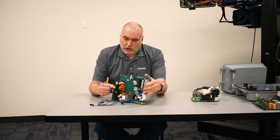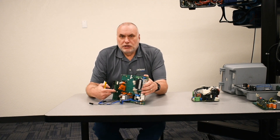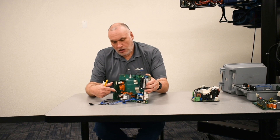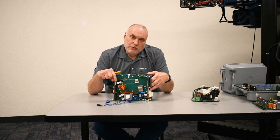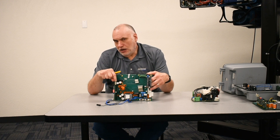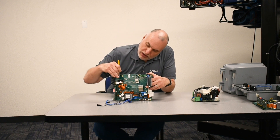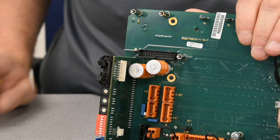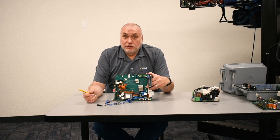You might see switch 6 turned on in the field — simply turn it off, as that's the proper running condition. There are more DIP switches besides the red cell: there's a cell of white DIP switches and a smaller cell. The small cell never needs to be changed in the field — it's in the run condition as the board is delivered and is programming access for the factory level. The number 1 switch in the larger white DIP switch cell turns on a CAN bus resistor at the end of the CAN bus branch. When there's no radio in a hoist on a crane, the end of the branch is this switch, and number 1 needs to be turned on in those cases. Basically, duplicate the switch position of the board you're taking out.